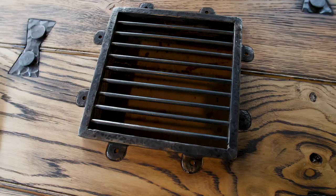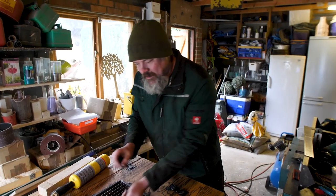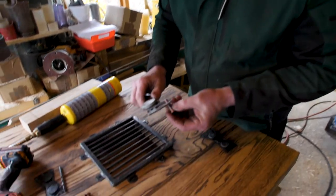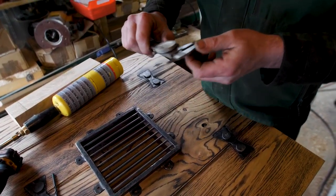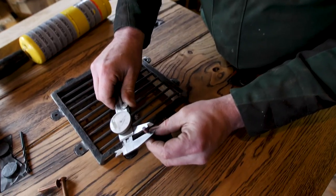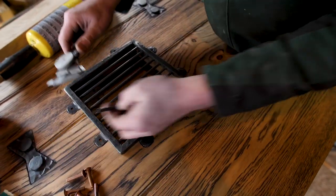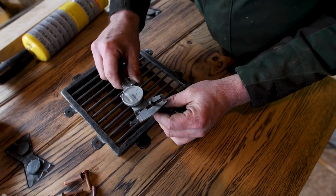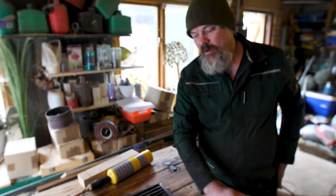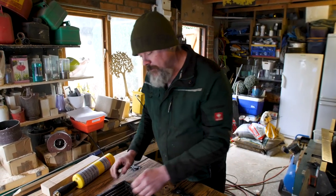Oh, it's fitting. It fits. So the top part of the outside of the door. And then, so what we're doing here, we've got our copper rivets. You've seen us make these before. And if you haven't, get watching our entire back catalogue. So we're just going to take a little measure of those. What's that coming up at? Practically 6. So what's this drill bit here? 5.5. So that means we're going to be gripping on half a mil of grip on each thing. So on each of these will be tight for the hole. So I think they'll work.